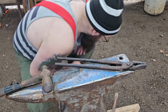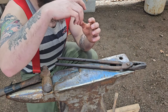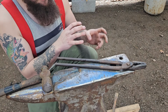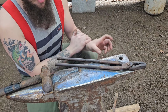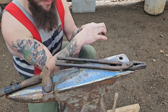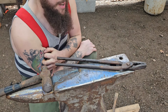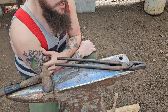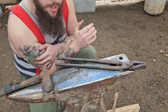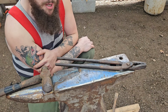Another thing too is that we're gonna have to take this pin and, where the brooch kind of comes around, wrap the end of the pin around it, which is gonna be interesting. I'm not too sure how I'm going to achieve that. Probably just a flat partial scroll and then set that on top and finish the scroll. Never done it before, that's kind of exciting.